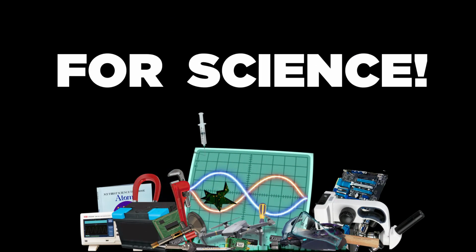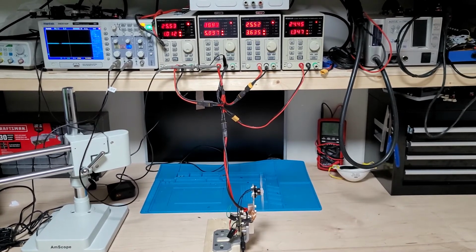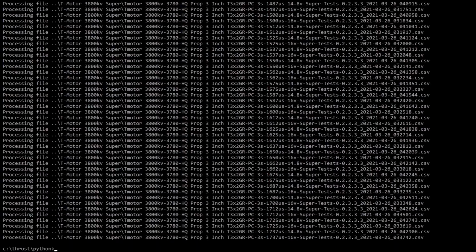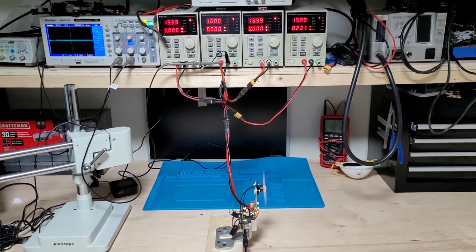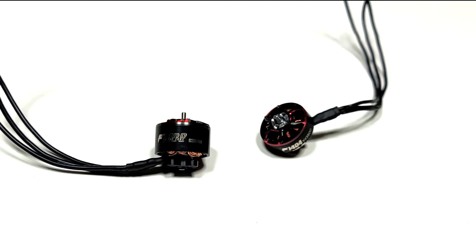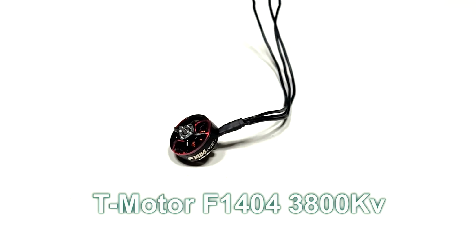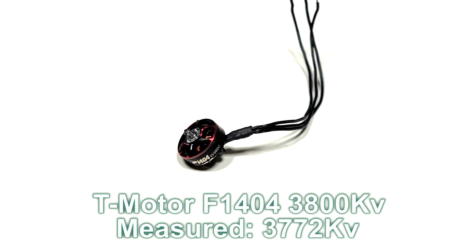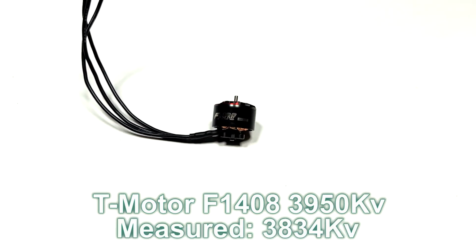For science. This testing will be conducted on my updated variable controlled motor testing methodology, which you can learn more about in the video linked in the description. These tests were conducted at 16 volts to emulate a 4S battery. The motors used in this test are T-motor F1404 3800 kV, tested at an actual 3772 kV. T-motor F1408 3950 kV, tested at an actual 3834 kV.